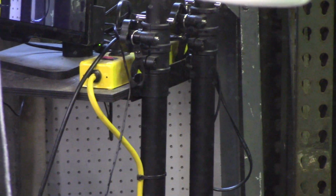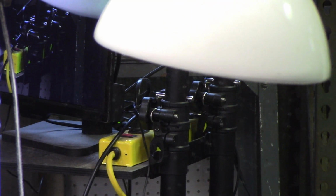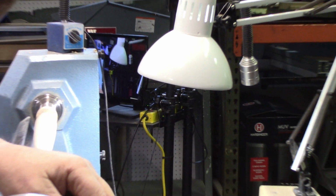This is a homemade beading tool that a friend of mine made. When I had the magazine, he did an article on making these. Basically what this is just a piece of metal that he left a little bit bigger, and I'll pass this around, and you can see what he did basically is just take a drill bit and drill a hole down through there and then cut it off in the center. And it does a really nice job of making a bead. You can see the type of beads that it makes on the handle, so you know what size it is.